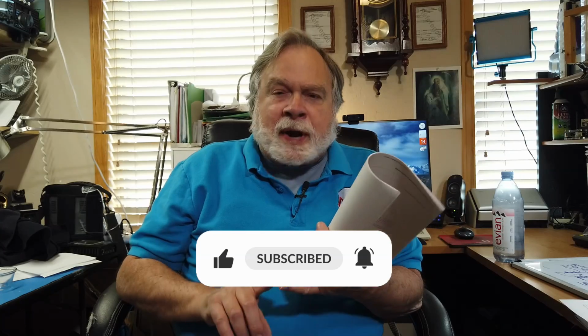So, break in the cable, look especially at the connectors. If the connectors are crimp connectors, use a trick that I put in Ask Dave some time ago, where you take a pair of pliers and you know where the cable comes over the center conductor, there's supposed to be a ring there. Just use your pliers to squash that ring, and oftentimes that will restore it. But make sure it's thoroughly waterproofed after you are done with it. So an open or a closed cable of a length needed to reach a tower could cause that problem.